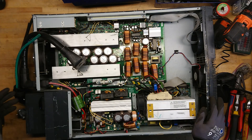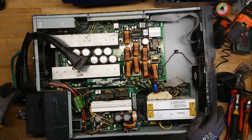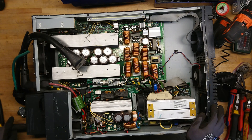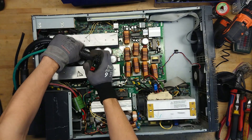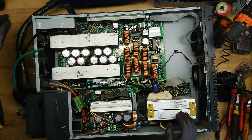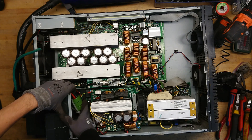If we start to take a look at the cables going in and out of this unit, we have these two black and green ones. This one says output, then there is normal AC source which is a rubber cable, and there is bypass AC source with nothing connected. And this is a battery connector — a standard high current DC plug.